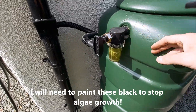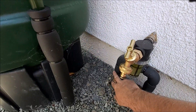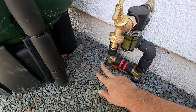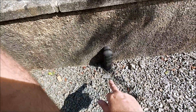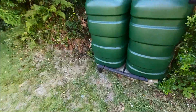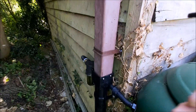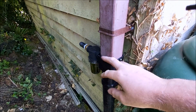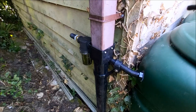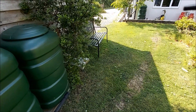The pipes from the other two collection points and this one - three in total - come up here where we've got a gate valve for each. This is all insulated underneath the ground as well. The pipe comes across, goes across the garden, and picks up two more tanks. At the back of the workshop, the gutter comes down into another collection point through a coarse filter and into the side of the tank. That's going to be replaced by the hopper with the filter built in. In total there's about 1,250 litres of storage.